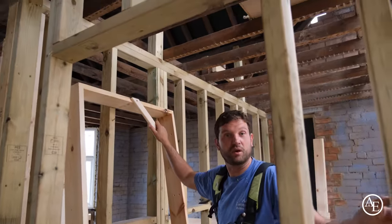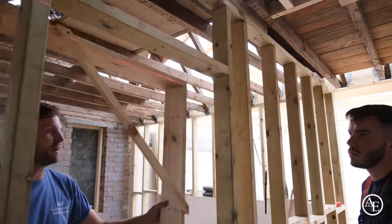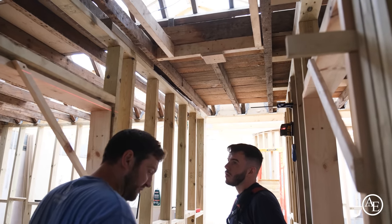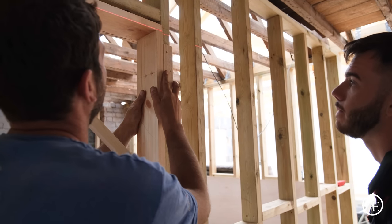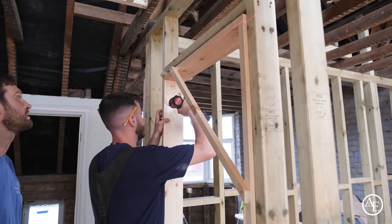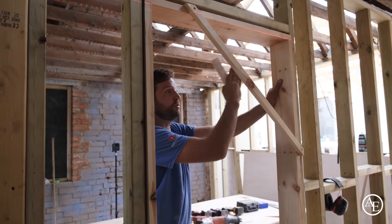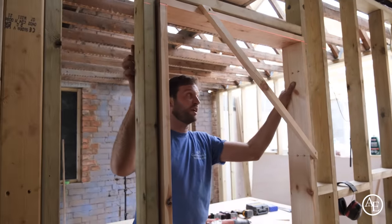Next stage is throwing them into the hole — we've got all the wedges machined up. Make sure you get the thing the right way round; remember what we did about the door? Typically, unless there's an exception, the door always opens into the room. Get your two-foot level. We had a 15mm make-up, representative of your plasterboard and skim, same both sides. You're going to lift it off, stick your first spike in, and level across. Then plumb down this way and fix at the bottom when it's absolutely plumb. You'll do this off your six-foot level, same on this side, working your way across. Once all your fixings are in — don't tighten them — start plumbing from each direction: get it at the right height, plumb from this angle, plumb from that angle, plumb from the internal.